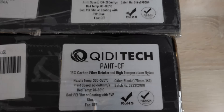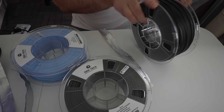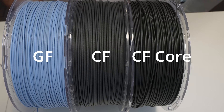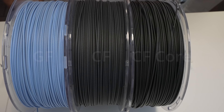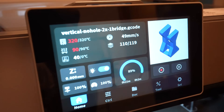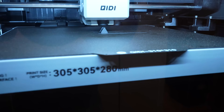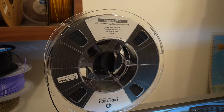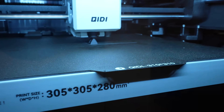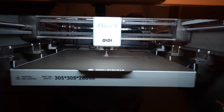It's time to test print temperatures above 300 degrees Celsius. I have a review in progress for KIDI PPA-based filaments. Most test objects are printed at 300°C but I want to test higher temperatures too. This is glass-fiber reinforced PAHT printing at 320°C, followed by PAHT-CF carbon fiber version also at 320°C, and Ultra PA — some kind of core version of the filament. The KIDI has a much better view to the nozzle compared to Bambu Lab, with great lighting.